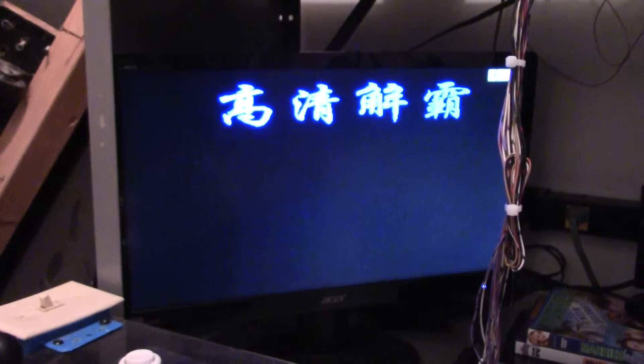These boards, by default, have a certain vertical position on the screen, and by simply adjusting the vertical position, it fixes the frozen screen. So allow me to show you here — I'll turn the test rig on. I have NBA Jam hooked up to one of these, going right here to the VGA monitor, and you'll see it's got a frozen screen.